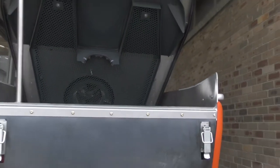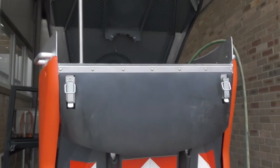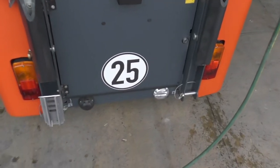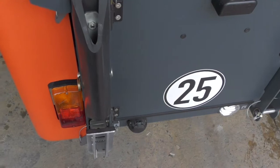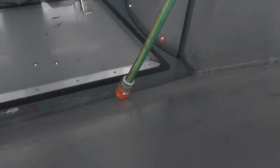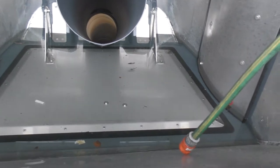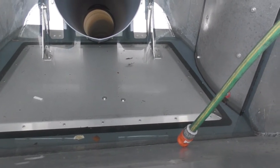If you'd like to see inside the hopper — unless you're exceptionally tall — there is a kick-down step on either the left or right of the machine depending on where it's been mounted, and there is a grab handle on the side. You can pull yourself up and see inside the hopper. You'll see along the side on one of the bolts a red washer, and it's at that level where the water should be when you fill the hopper to assist dust suppression.